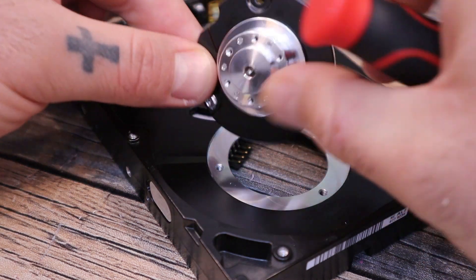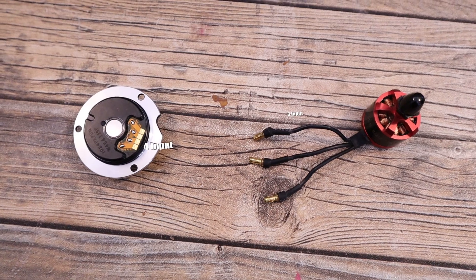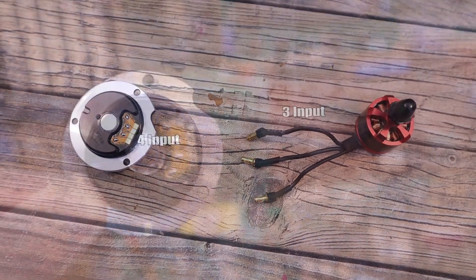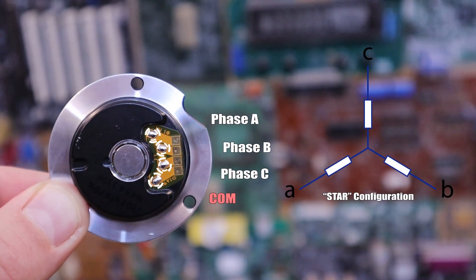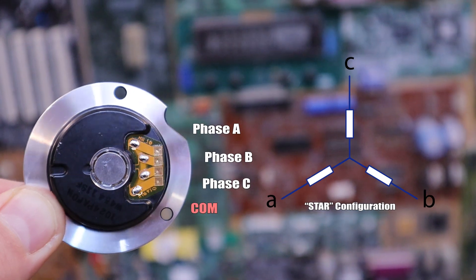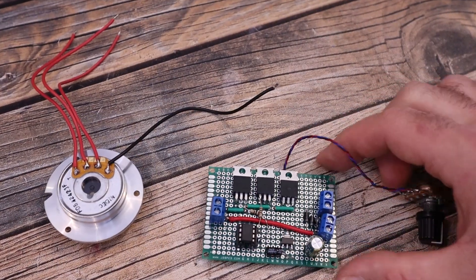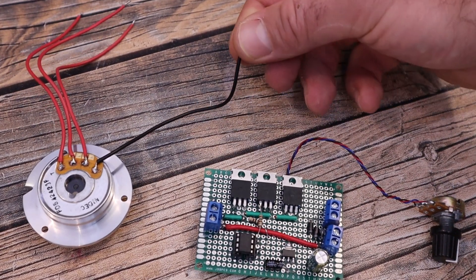So what's special about this motor? As you can see, it has 4 inputs instead of 3 like a common brushless motor for drones. It has the basic phase A, B, and C but also the common point of the star configuration — and that's the key for this project. In order to use a half-bridge ESC, we need a connection to the middle common point of the motor.